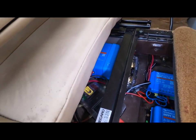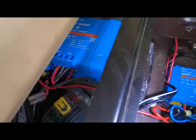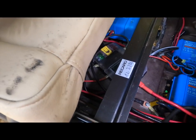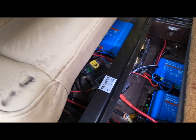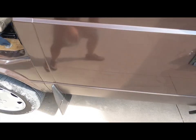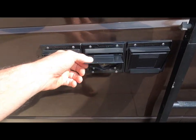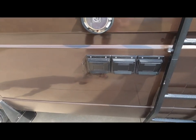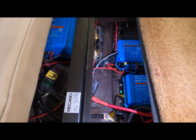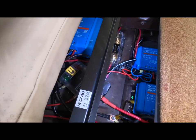There's the Orion — if you watch my wiring diagram video, you know how high I am on that piece of technology. And even further tucked in is the Victron AC to DC charger. It takes the energy I can bring in from shore power, plugging directly in here, and converts the AC over, dumping the DC energy into my Battle Born battery. It charges at either a slow charge of four amps or a fast charge of 15 amps.